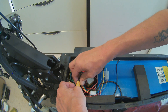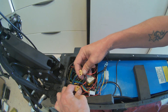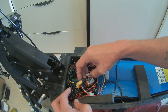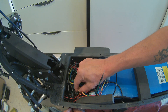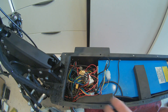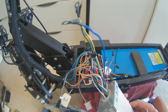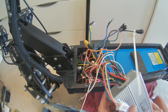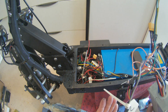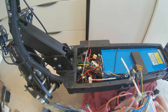Then you have the direct 60-volt feed coming from the battery. So there we have it — we should now be able to feed the cables through. Apologies for not keeping you in the loop while doing it; I think you'd have found it quite boring and, quite frankly, I didn't know what I was doing. Every controller and every wiring is different for every scooter pretty much. You have the standard color encoding for the output, the controls, the motors and the Hall effect sensors, but the electric brakes, the throttle — everything else is pretty much bespoke.